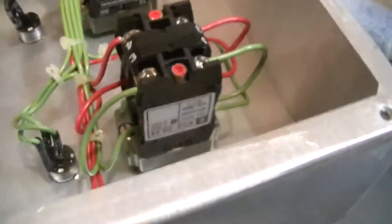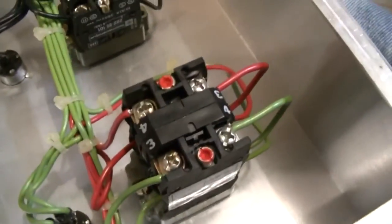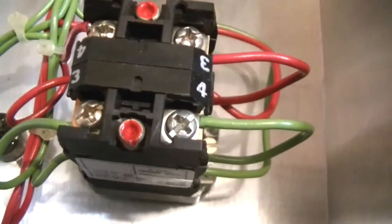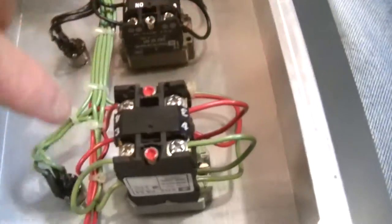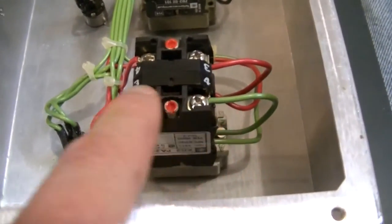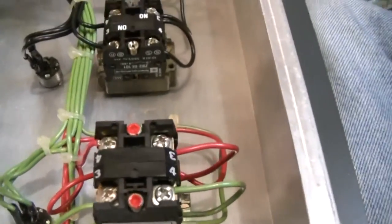Now these joysticks are actually only switches. When I put it one way, that moves one switch, and that's the green side. When I move it the other way, in that same axis, it pulls the other switch down, the bottom part of it. So when you move it in one direction, it will contact these two wires together, and if I move it in the opposite direction, it contacts these top two wires together. That's how it works.